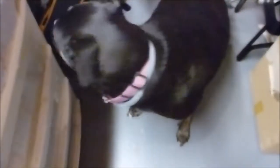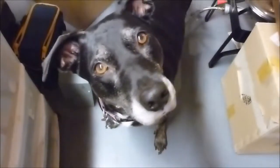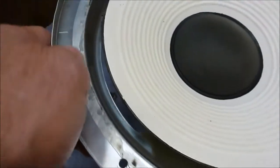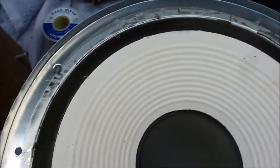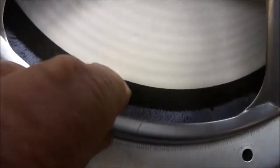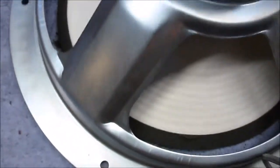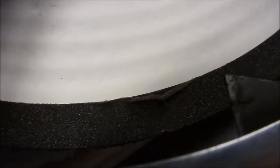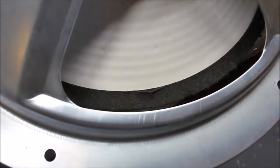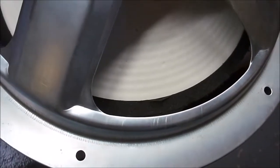We got the basket kind of cleaned up — scraping all the glue and old foam surround off. Now the real fun part is getting to the back side of this white cone and trying to scrape this stuff off. What you do is take the knife from under here, get behind there, and try to scrape at it and get as much as you can. It helps to get a little bit of alcohol on a paper towel and rub it down too.